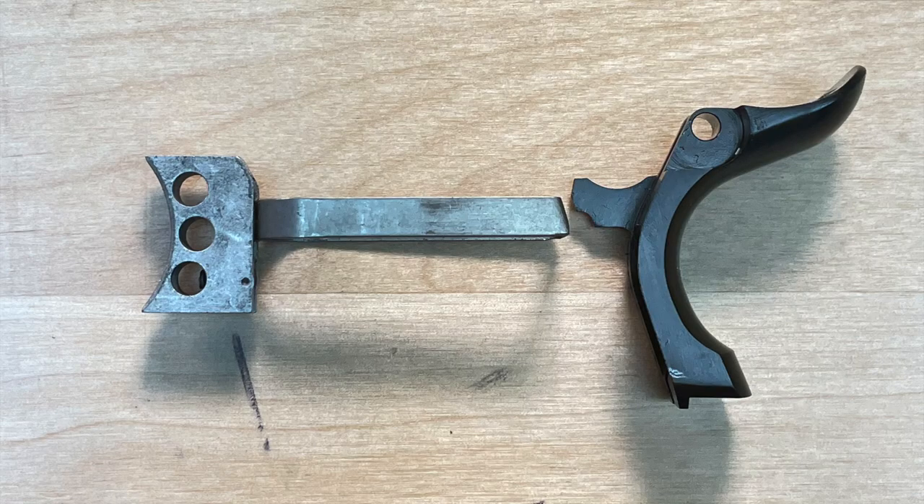So what does this issue actually look like? If you crack open the inside of a 1911, the grip safety has a little arm on the inside that pivots up and out of the way to free the trigger bow and allow it to move. If that arm is dimensioned or fit such — and it has to be fit by someone at the factory, and how much attention they put on it determines how your gun works — there will be variance. The Staccato factory, at the time I contracted with them, had a specification where the grip safety was supposed to disengage at about halfway through its travel. Halfway is pretty subjective, and getting it tuned exactly is time consuming, so there's going to be some variance on each gun.